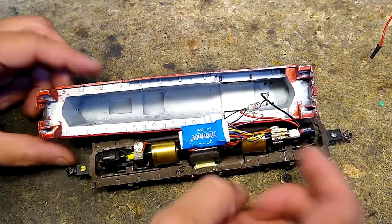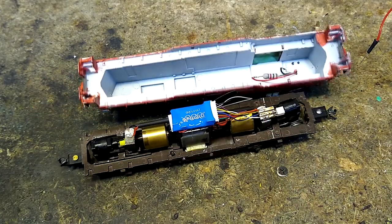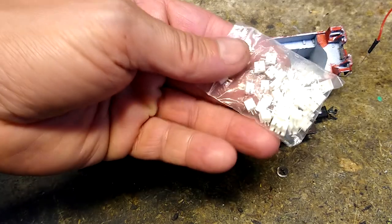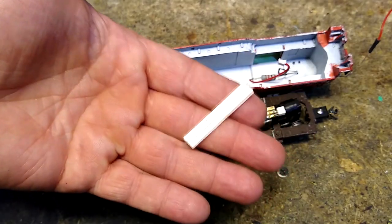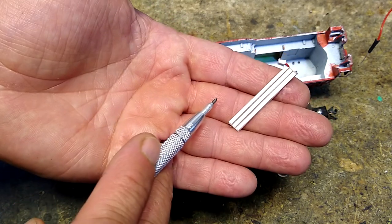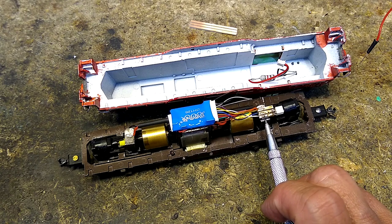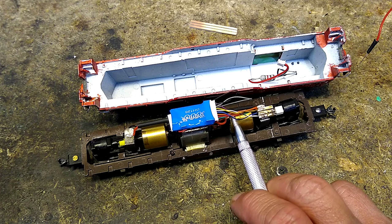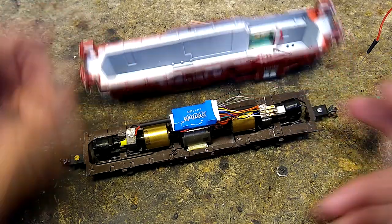In this setup I put a little disconnect — I can pull that right out. It's a little two-pin connector; you can get bags of like a hundred of them, with little sockets they connect to. I made a PC board with three lines through it — two gaps — then I took a little piece of styrene, put some goop on it, and placed the board right there above the flywheels. I don't want any wires getting caught up in the flywheel.